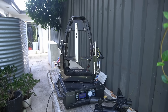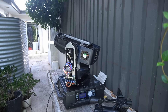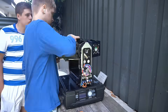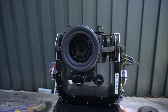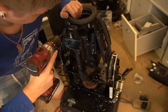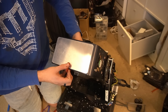Turned it on and found out something very annoying. When the light boots up, it tilts all the way to one side to find where the centre is. Turns out that side it tilts towards is the side I mounted the camera on, so I had to mount the camera on the other side. After doing this, I added a counterweight, and now we have the basic framework figured out. Next, I had to deal with the problem of the camera flipping over and hitting the screen. To fix this, I added a metal bracket over the screen which takes the impact instead. I also added a metal mounting plate to the counterweight so it wasn't relying on structural zip ties.